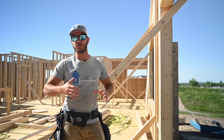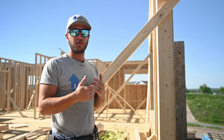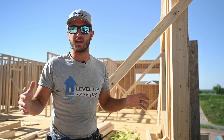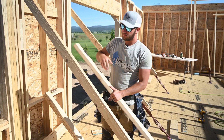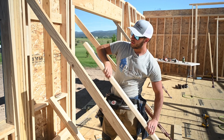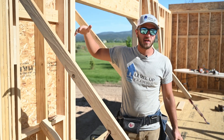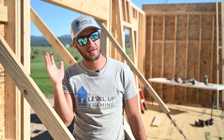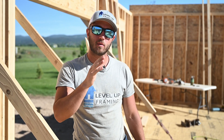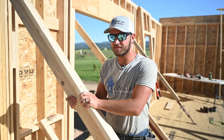In high wind areas, you have to be really cautious when bracing your house, especially if the walls are sheeted. I have personally watched a 3-inch structural screw snap during a windstorm — we were running through the house just putting braces on everything trying to keep it up. So make sure your walls are braced really well. On really long braces on big walls, put an L on it — screw or nail it down to the board — because on longer braces, especially a 30-foot brace on a 25-foot rake wall, they will bend a lot in the middle and make your wall move. The wobble is what takes houses down, not a big gust of wind. It's wobbling back and forth for an hour, slowly working those nails up and out.